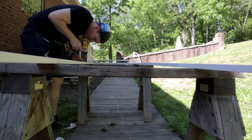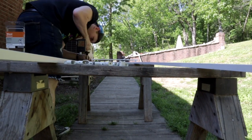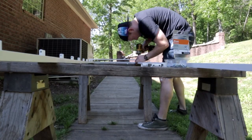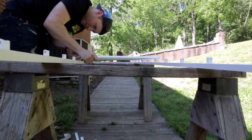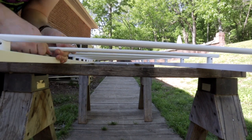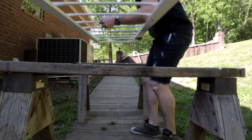Next, drill all of your pilot holes. It doesn't matter if you go all the way through the board — you're going to paint the back anyway, and if you don't, it's facing a wall. Now install the base of each rail: take the screw, put it in the base, place the screw tip right in the pilot hole, and let the drill do its job. Once all the bases are installed, put the rails into the base and then install the screws that hold the rail to the base — tightening each one takes a while, so be patient. Once all screws are tightened, you can flip it over and paint the back.